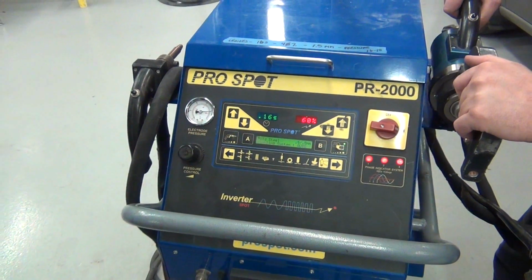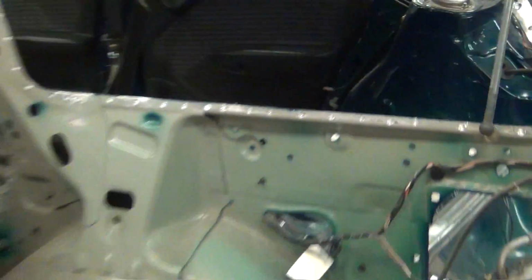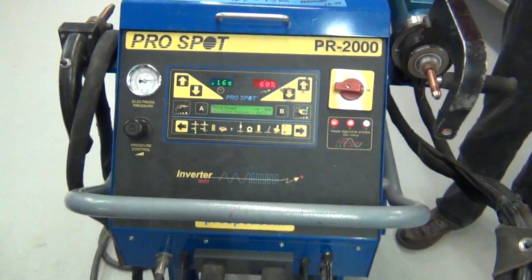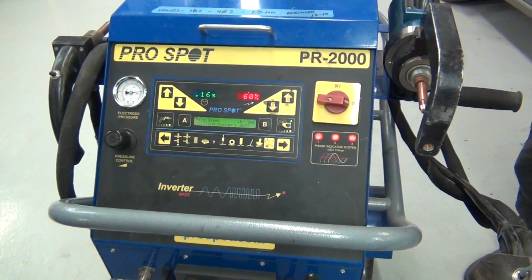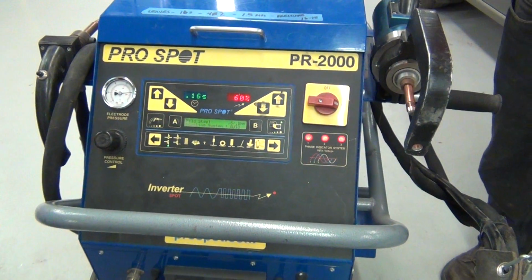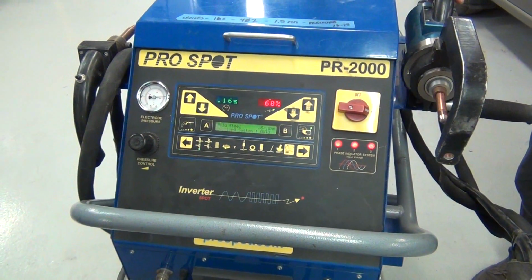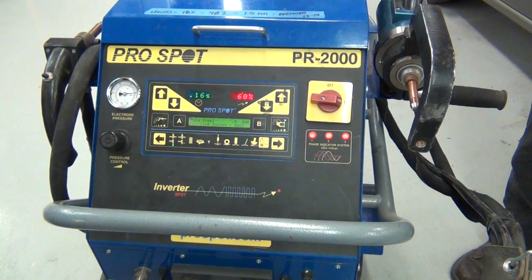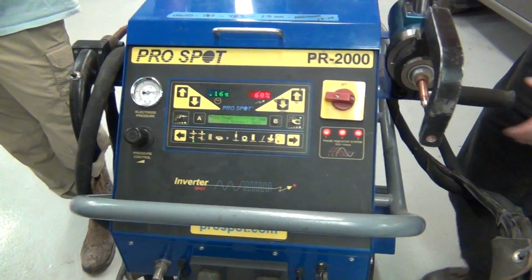So if you had 2 pieces on there, which happens, what are you gonna choose? You got 2 pieces on that wall? What's your number? 2.0. He's trying to be slick and say, okay, if you have metal this thick and you have it doubled like is in right here, what would you set this machine to? 1, right? Exactly. 1 thickness of the steel. So you would measure both thicknesses, divide by 2. Cool. Makes sense.